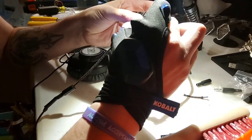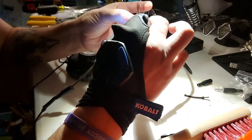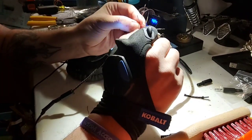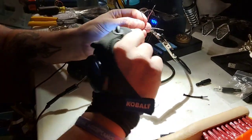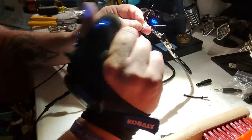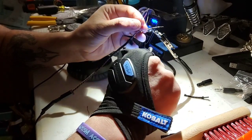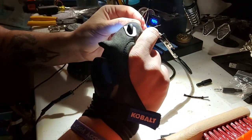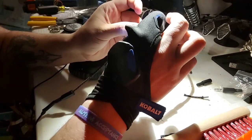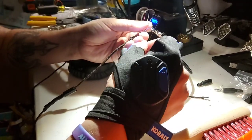Okay. So the next piece that I'm looking for here, I've got right audio, which I think is supposed to be red. And this is, I believe, red black. If that's correct, which again, I'm colorblind, so I can't 100% tell. The best way I was able to determine this is actually knowing where the third pole is, which is right here. What I did is I connected up the headset and put on some audio, then touched different wires to the third pole, and so I made sure which one was actually my ground. And I figured out that this is my ground here. So this is what we connect up to the third pole. That would make this one the second pole. And then these two that are together are your microphone and microphone return, or microphone ground.